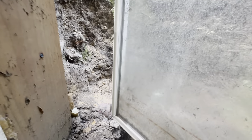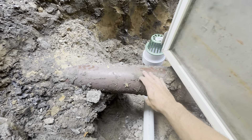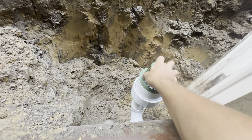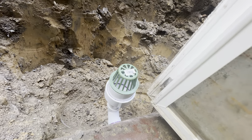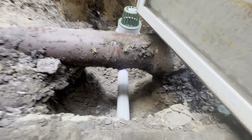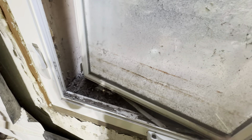Outside, there's a piece of drainage pipe sitting right where I need to work in the window well, so I had to work around that. The drain here is basically a cap that goes onto a standard 3- or 4-inch coupling — they sell that at Home Depot — and then that comes down to a 90-degree elbow. I did not put a trap in there; I'm not sure if it's necessary. Maybe somebody could leave a comment to tell us what should happen underground there. I didn't dig up the other window well to see how a professional would do it, so we'll hope that's right.